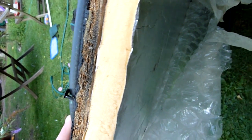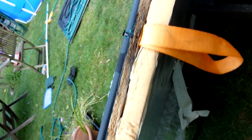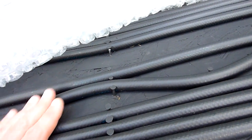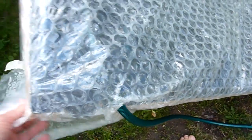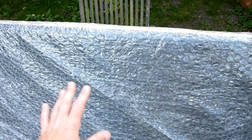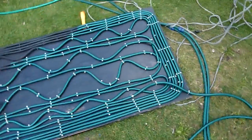This is just scrapping from a tip, left over from doing a roof — just adhered onto the back. The other thing we found was that with the wind, you're having the heat taken away as the temperature rises. So all we did is just got this simple bubble wrap — I just peeled it back there just to show you. The bubble wrap lets a lot of heat through, so it's basically just like a greenhouse. You've got the sun hitting it, warming the pipes behind, keeping the heat in — can't get out of the back, it's only got one way to go, and that's into the water flowing through it.